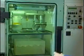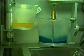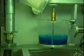The chamber is again evacuated, and after 3 minutes, the mixing of the A and B components of the PU resin begins. As the pot life starts at the beginning of this process, the stopwatch inside the chamber is set back to 0 seconds automatically.